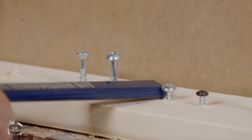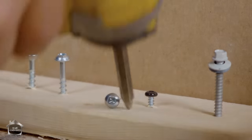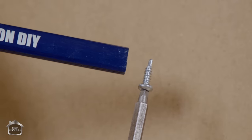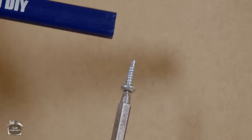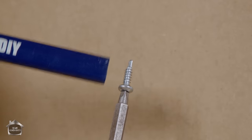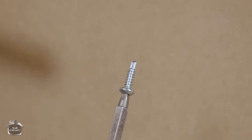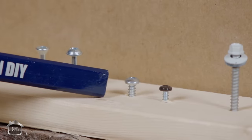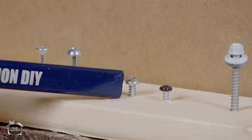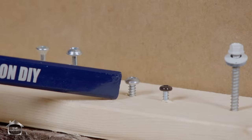This screw here is really short — it's a self-tapping screw. This type of screw is used, generally speaking, if you're using metal framing in your house or basement. What it does is pre-drill the hole in the metal and then uses a fine thread to tie two pieces of metal together — a brilliant little idea. If you have to attach things that are metal, self-tappers are great. Just remember: this one does not hold into wood worth a darn. The threads are too small and half the screw is just a drill bit, so it's really useless with wood.